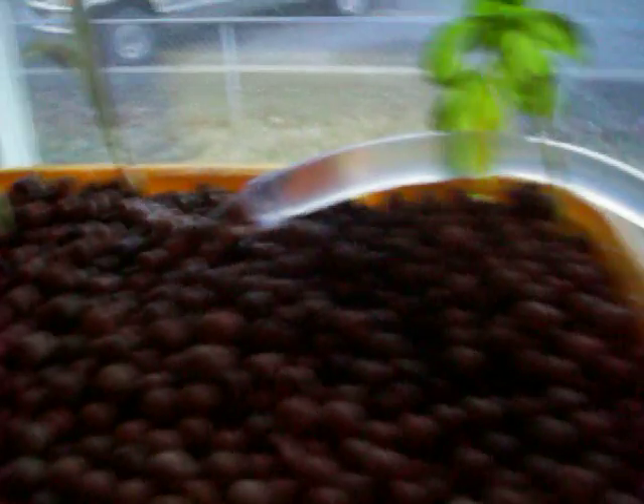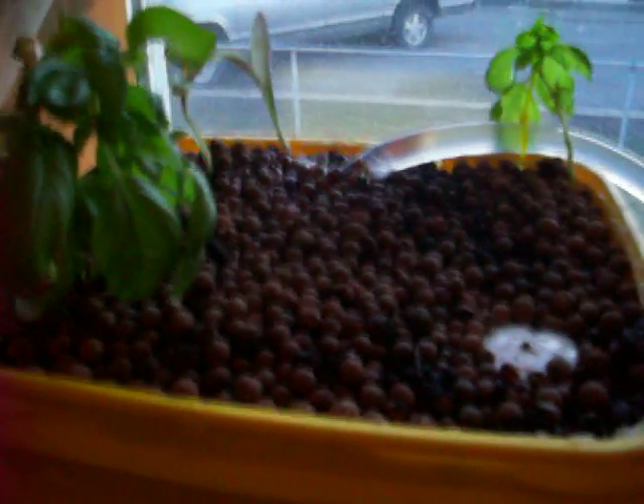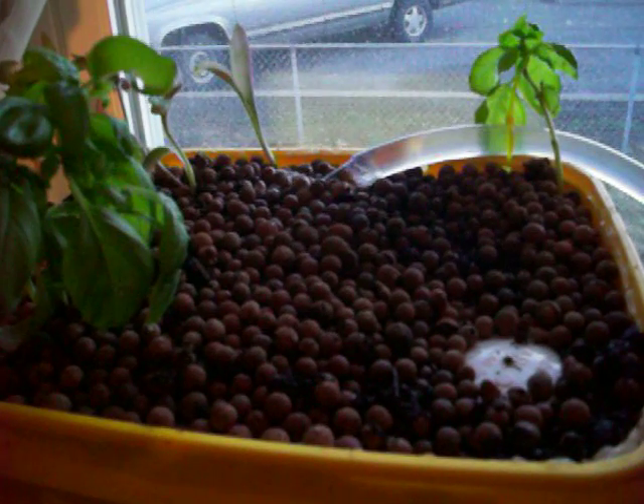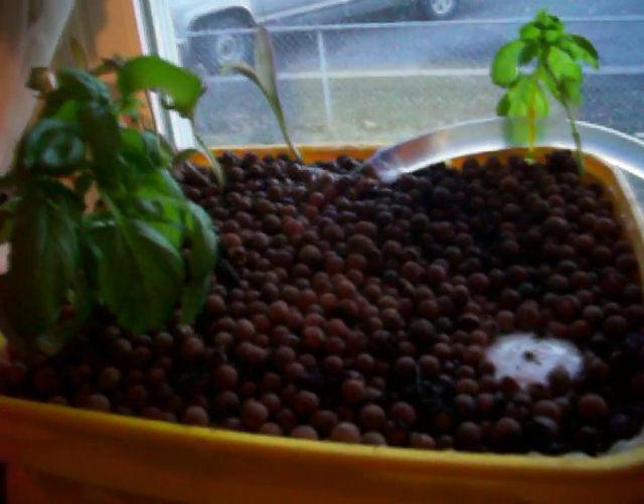This is a timer that I hacked. It was originally a 24-hour timer, but I took one of the wheels — one of the gears — out of the timing mechanism. The cycle for each tick is about a minute 50, so it comes out to about 33 minutes, which is what the 24-hour cycle was turned into when I pulled that gear out and glued two other gears together.